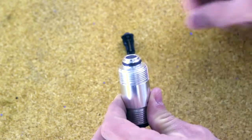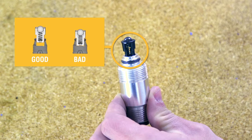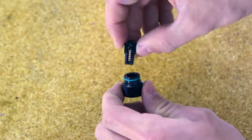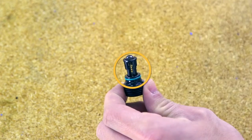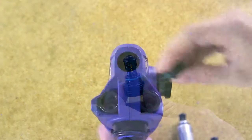If the outlet valve assembly was removed from the valve plug, reassemble as shown, making sure to leave space between the end of the plug or front valve and shoulder on the outlet valve assembly. Do not push the outlet valves all the way into the valve plugs or front valve. If pushed all the way in, the sprayer will not perform correctly.